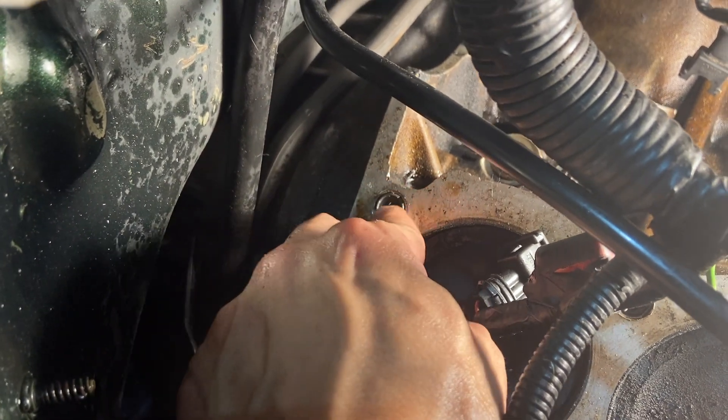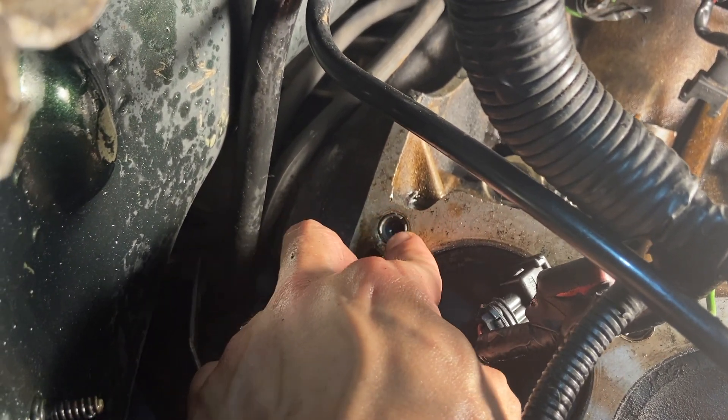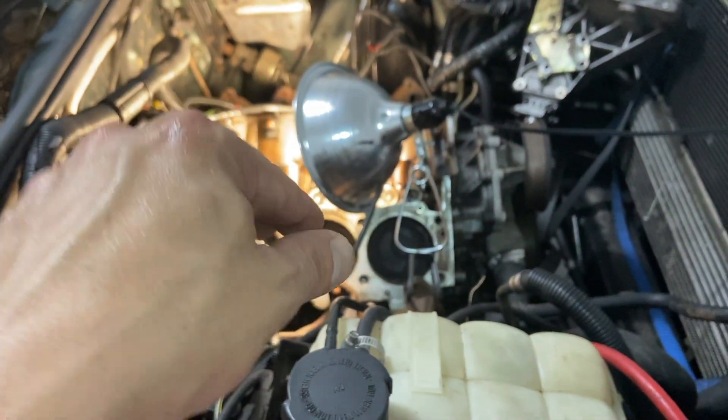Here I've put my first insert in after drilling out the hole, just to test it. You can't see it but I can feel it — it sticks out just a little bit, which means I'm going to have to grab my tap and make it a little deeper so I can put it in flush.